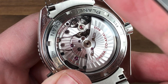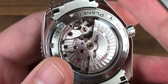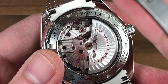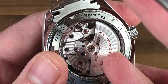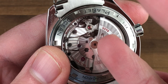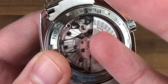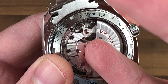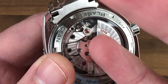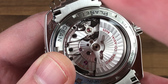It beats away at 25,200 vibrations per hour, five-position adjustment, COSC chronometer. It is anti-magnetic with a silicon hairspring and very shock-resistant with a full balance bridge and a free-sprung index — 38 jewels — with a handsome arabesque spiral Côtes de Genève across the rotor and bridges with blackened rather than blued screws. It beats at that quirky coaxial-specific rate because this is the latest tri-level coaxial escapement: a direct and indirect impulse exotic escapement that remains the most sophisticated you can buy for under $50,000, invented by George Daniels in 1974, industrialized by Omega in 1999, and today largely perfected, extending maintenance intervals to over half a decade and allowing superb precision in between services.